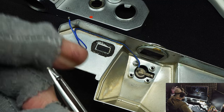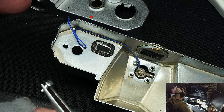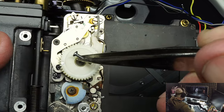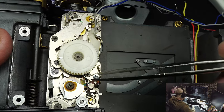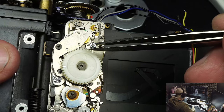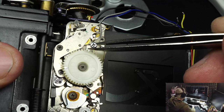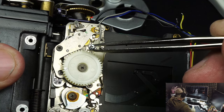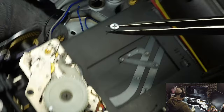You can see what kind of head it has — it's kind of rounded and it's a Phillips. That gives you a clue as to what you're looking for: the relative size, the type, and the head, which is rather shiny and polished. Now looking at all the screws visible inside the camera, you can tell immediately that none of them come close to a match. So you need to look through the mirror cage and other parts of the camera for something that looks like this sample.